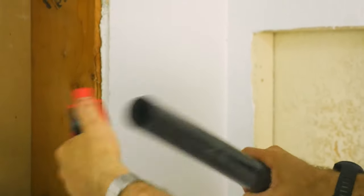I'm going to leave that nail — no big deal — and this nail here too for a little more support on the old drywall. Let's measure for some new drywall: 16 and three eighths, 16 and a quarter exactly. Let's go down and double check — 16 and a quarter, 16 there, reduces a little bit. The first piece is going to be two feet, so 16. Let's cut the drywall 16 and a quarter by two feet — you could do it in one section but I just bought small pieces.